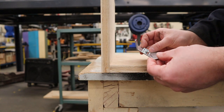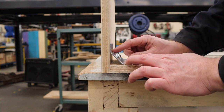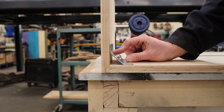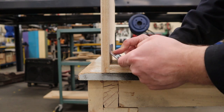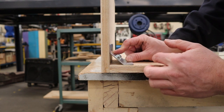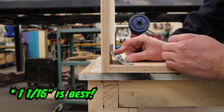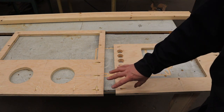So when you go to install your pinball legs, you're gonna have this bracket on the inside and it's going to get screwed with 6 screws to the inside of the cabinet. Now, this area here is where we have to make that brace so that we can have some glue strength to keep this corner nice and strong. But you can see if we leave this square, it's not gonna fit in there. So the one corner has to have a 45 degree angle. Now, in order to get this to fit and have the maximum amount of glue space, you're gonna want these edges here to be 1 1/8 inch and no bigger. They could be a touch smaller than that, but if you make them too small, then you're losing some glue strength.